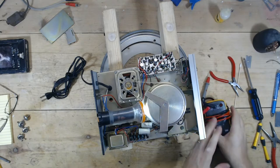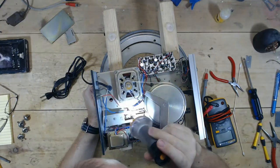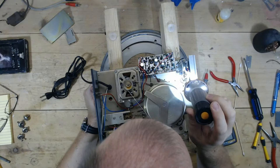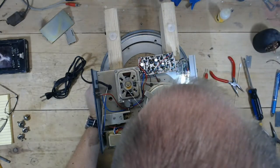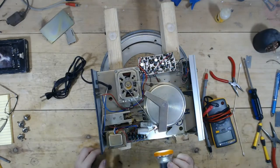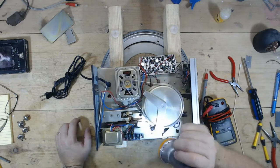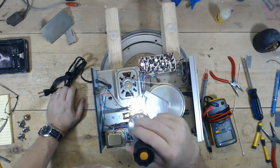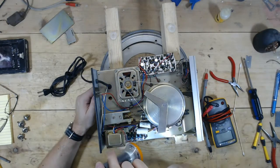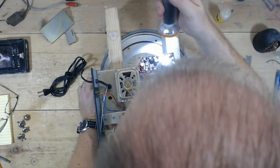Looks like there's some kind of muting switch — maybe I have to look at the schematic. I don't see which ones are the channels. This is not a recorder, but sometimes on a recorder the recording switch can cause an issue. I'm thinking I may have to feed a signal into this board — a one kilohertz tone into the right channel and the left channel — and see if it's good going in but bad coming out, meaning it's being lost somewhere in this board.